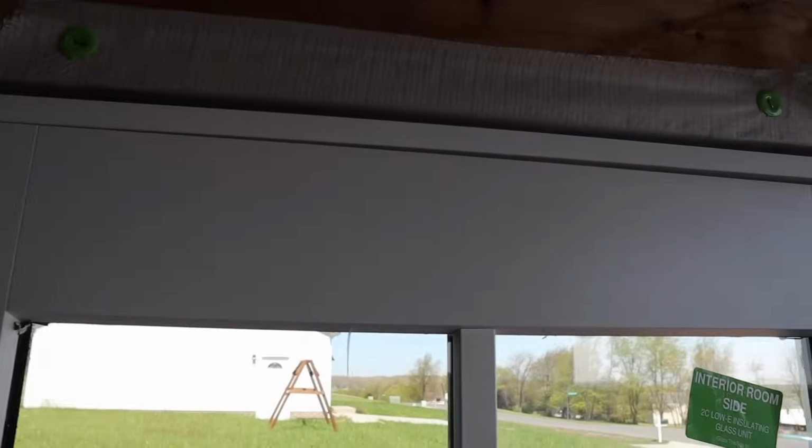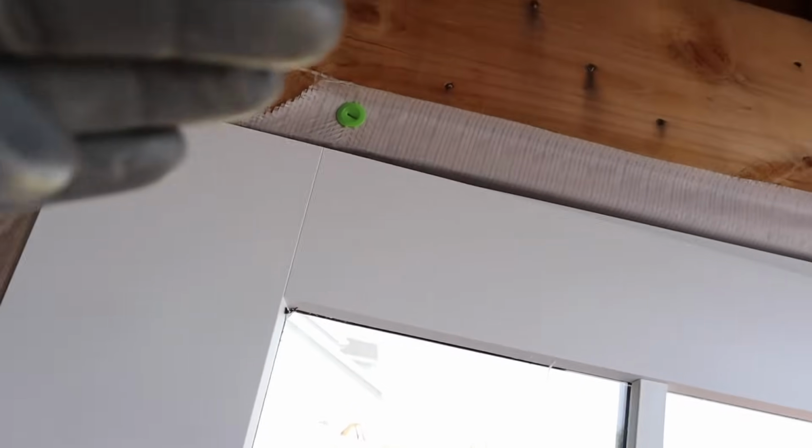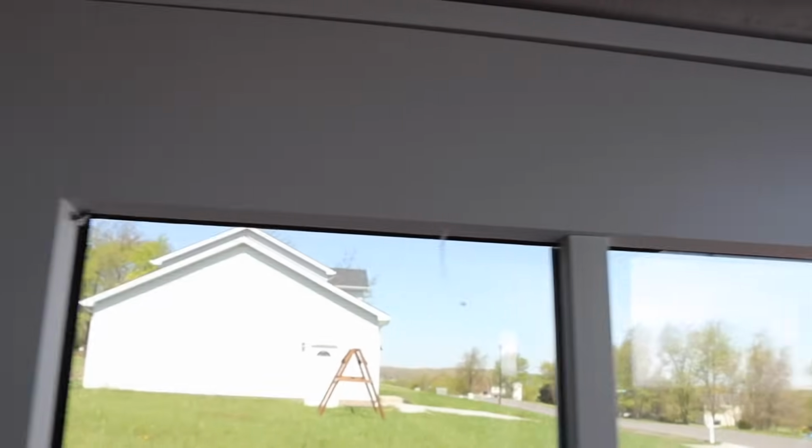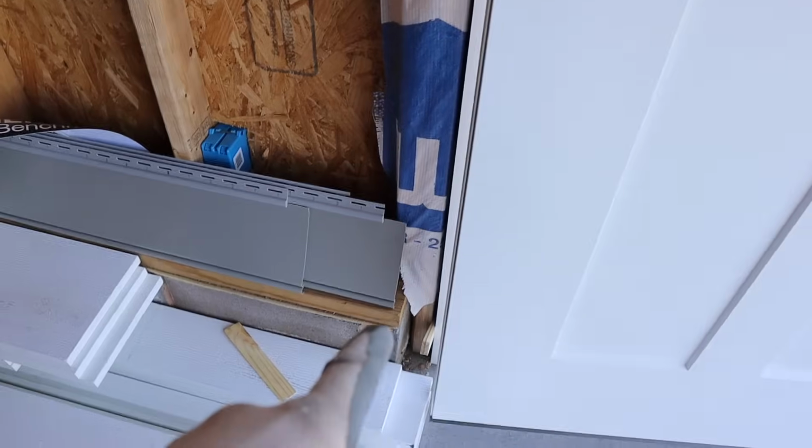And sometimes it's okay to have more of a crack on this side than this side, because over time the weight will pull this door down some. So it'll actually straighten that reveal out up top, just FYI. So I've got a shim in this top corner and in the middle and at the very bottom.